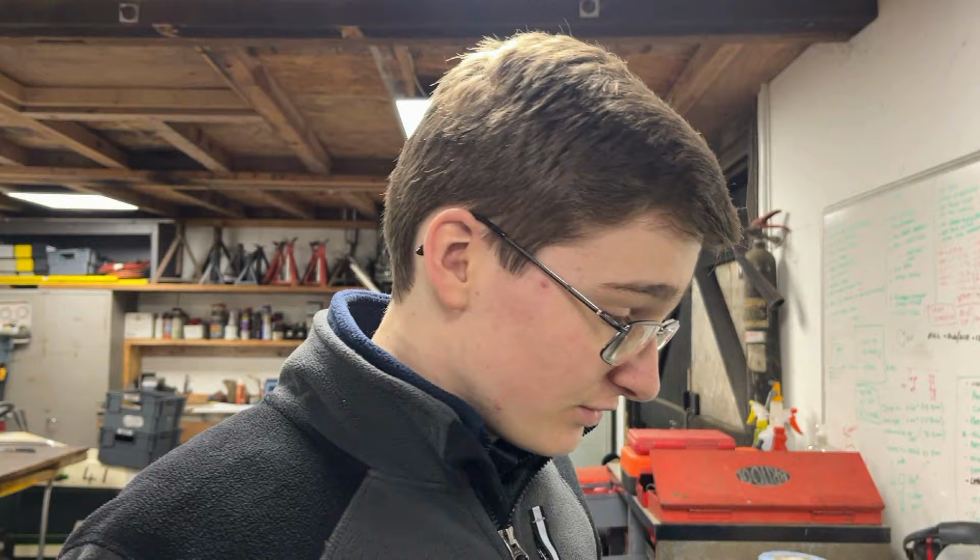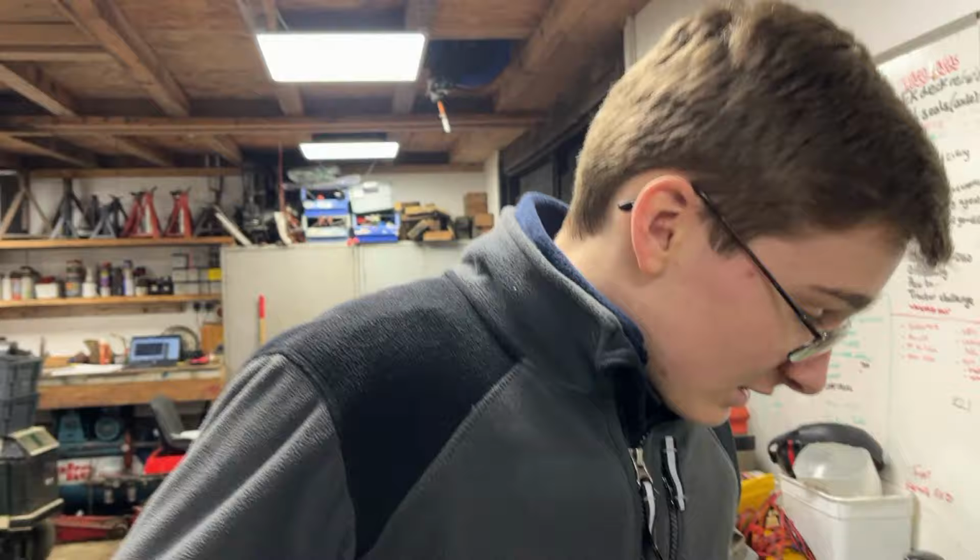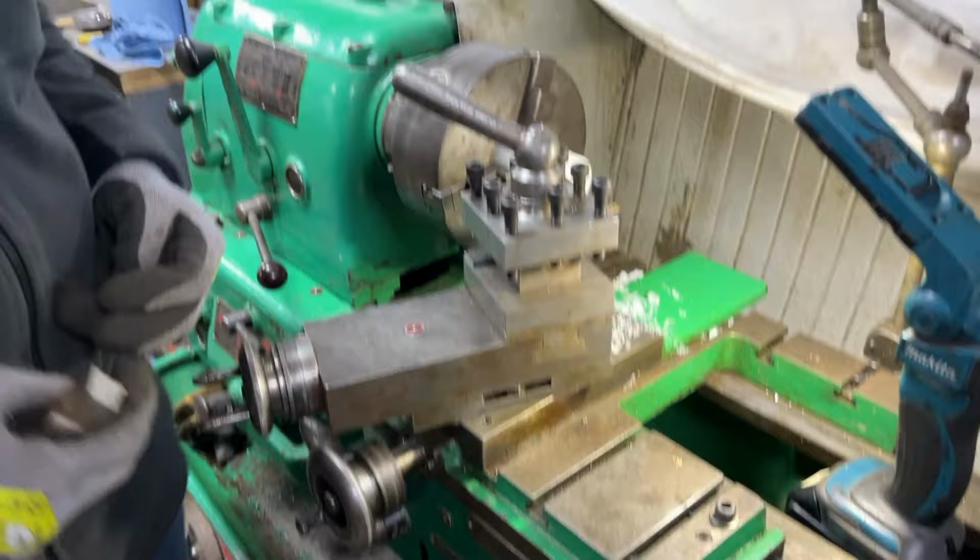The drilling of the hole through the centre went quite well, and that was the easy bit over, because after that we had to cut the 20 degree angle on the front of here, or 70 degrees depending on what way you look at it. This took us absolutely ages, mainly because we were struggling to work out how we were actually going to get that angle cut on there. It took so long that me and Dad were completely stumped, and in the end we phoned a friend, Malcolm, who helped us work out where we had to put the compound to get the right angle on there. So thank you very much, Malcolm, and that is at 20 degrees